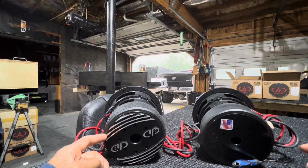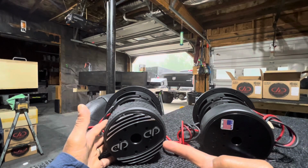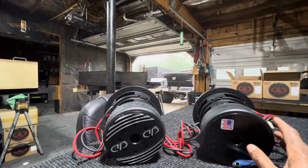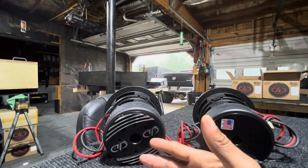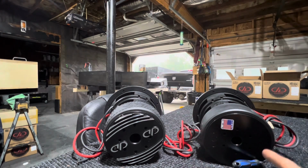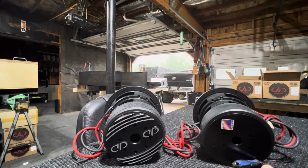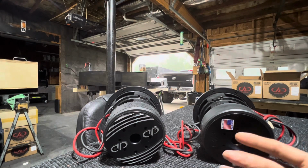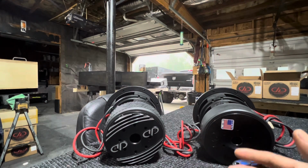But the bottom plate had to be modified, and different magnetic slugs had to be used. So this is actually a slightly bigger motor than this motor. Specs are roughly the same, but this motor is going to be a little bit stronger. Now, both of them are supercharged, but because of that added metal plus the heat sink, it's going to be able to cool far faster than the old revision, and you can see this visible improvement. Also, that added low carbon steel, that added metal, is going to increase the magnetic flux inside the gap. So now it's even stronger than it was before you supercharge it.